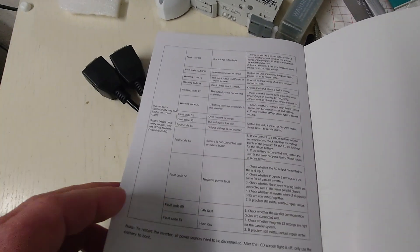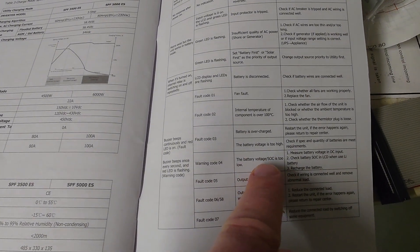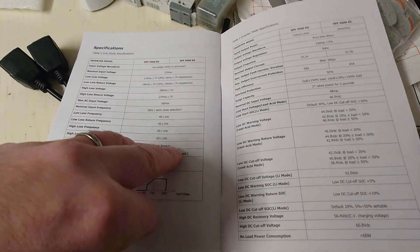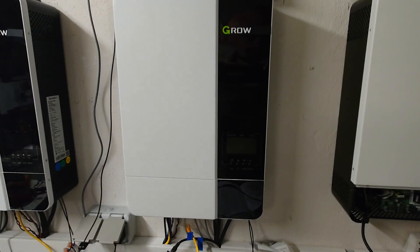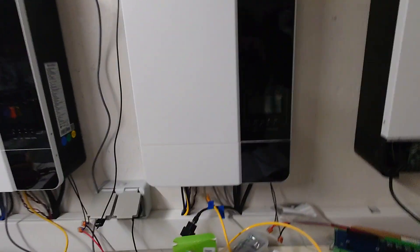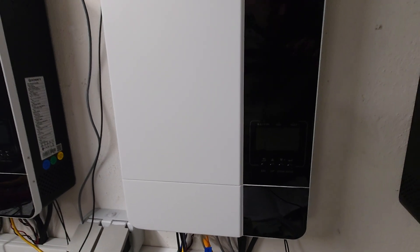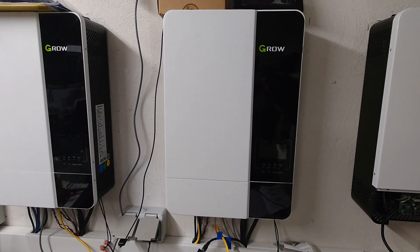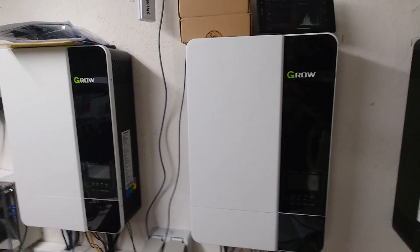Let's check quickly what these messages are. Warning code 4 is battery voltage SOC too low — that's clear because the SOC is not readable anymore. And error 20 is BMS communication error. So the inverter shuts down as soon as it has a fault. This is only triggered if you use battery communication, and it's actually not something bad — it's something good, because the inverter realizes there is something wrong with the communication to the battery or the battery is faulty, and that's why it shuts down.